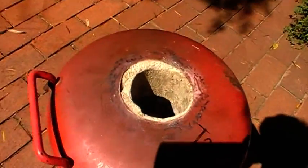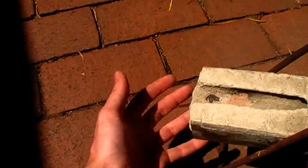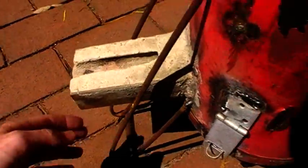Load in bits of cast iron, plug up this little hole down here, and after a while when it starts melting you unplug it. And you put your nice crucible under here and collect the little bit of molten metal. And there you go — you might start making things.